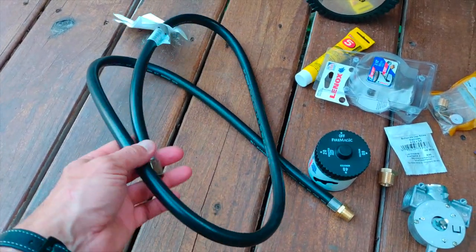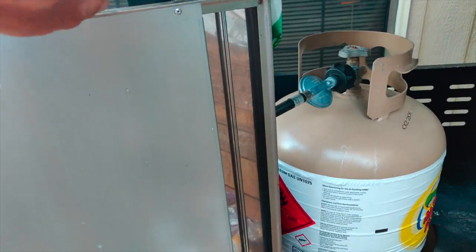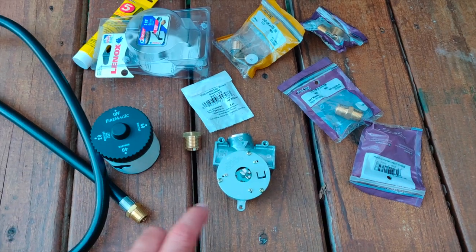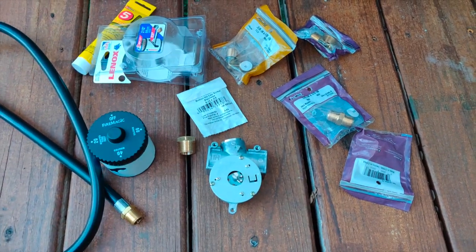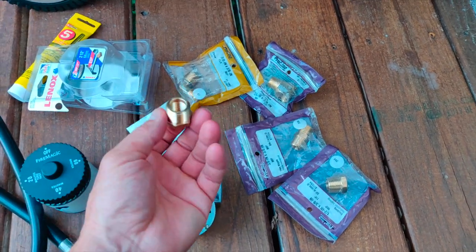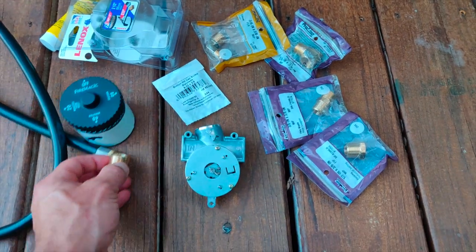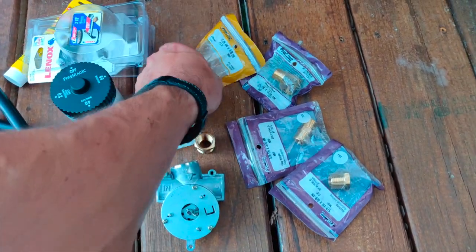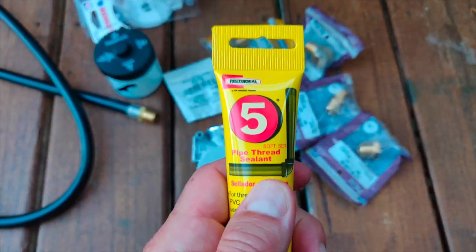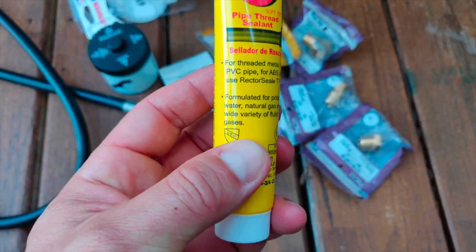I got an extension hose. Because I only have the one line going from the propane tank to the grill, I'm going to need that to go into the valve, and then another one out of the valve and into the grill. Some various fittings to both reduce from 1/2" to 3/8" to fit the hose, and then also a couple of elbows, and then finally some pipe thread sealant that is okay to use for natural gas and a wide variety